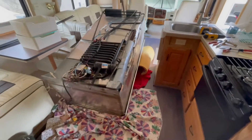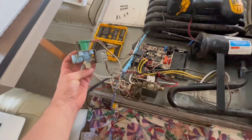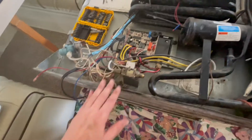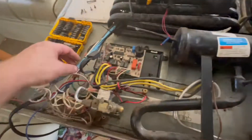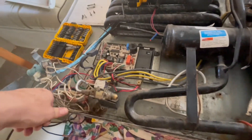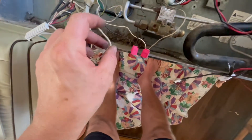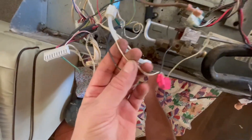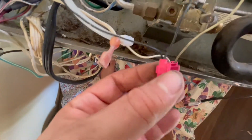Pressing on — checking in, just removing stuff. I've got the ice maker out of the way. That's the control board, and basically I'm just following along with their video and so far everything's pretty much like it's supposed to be. I've got two little white and black wires that come out of this big plug with joints, and they go down into the wire bunch into the fridge. I'm going to disconnect them right here — black to black, white to white — and make sure we can put them back.